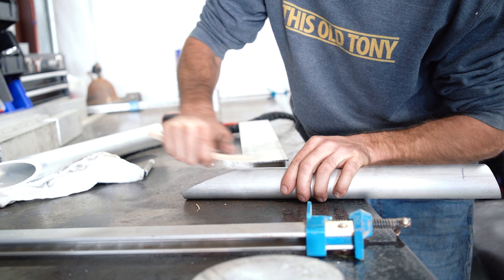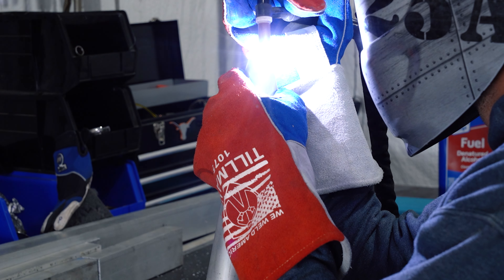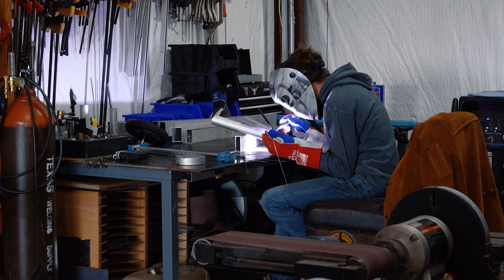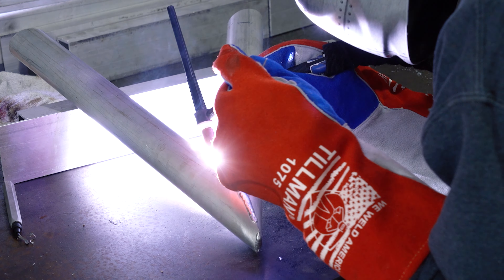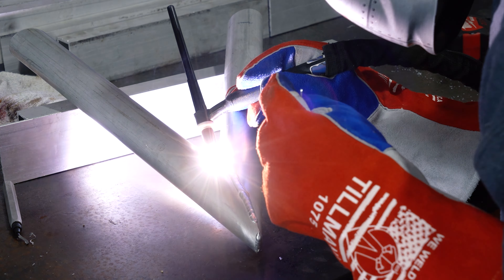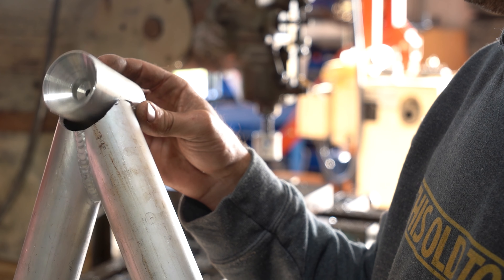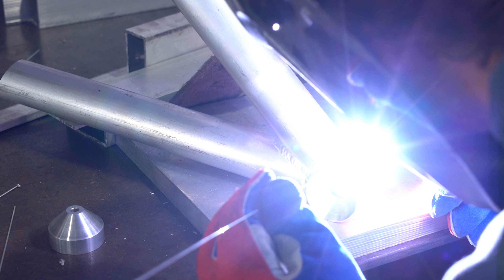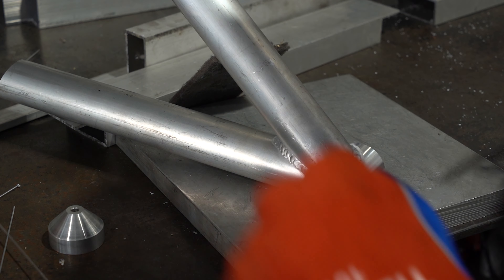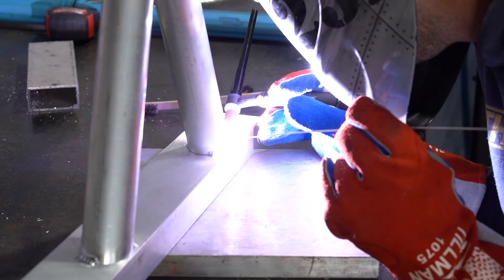Anyways, working with this aluminum reminded me of a tip I want to share. The aluminum I used in this build I've had forever - I have no actual memory of where it came from. Every time I try to weld it I don't get the best results. No amount of cleaning, brushing, or wiping with acetone makes a difference - my welds look dirty every time. Who knows what these sticks have been through. When you're first starting out welding, especially TIG, you run into these materials and no matter what you do they will not weld, or look unprofessional at best - after you've replaced your torch, swapped out different cup sizes, tried all the different types of tungsten, got a new tank of gas, more cleaning and scrubbing, possibly even buying another welder - do you realize hey, maybe it's not what you're welding with, but what you are welding.